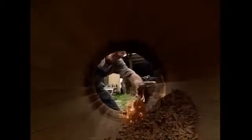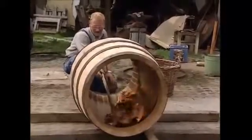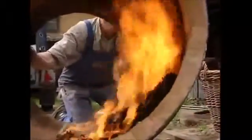Next, the cooper will toast the interior. What the cooper is doing here will have a really big impact on the flavor of the wine stored in this barrel. A small fire is lit to singe the wood. More singeing will mean a richer, smokier flavor for the wine. But he has to be careful not to burn the barrel too much — that would ruin the wine.